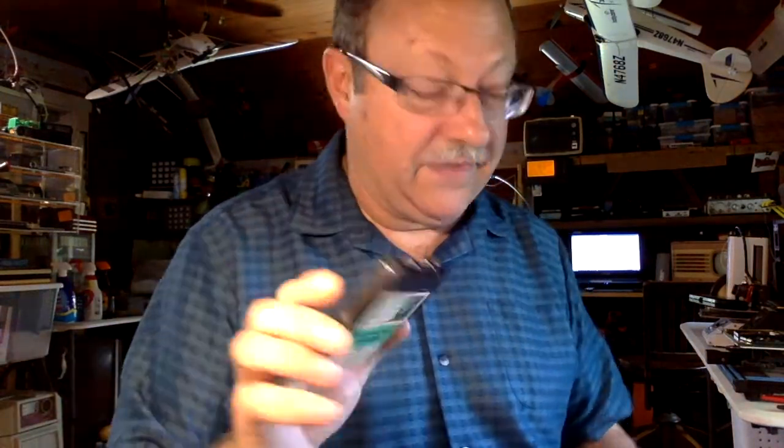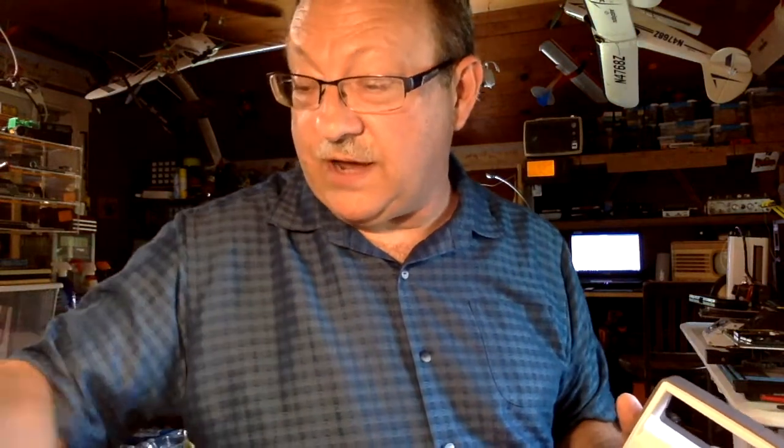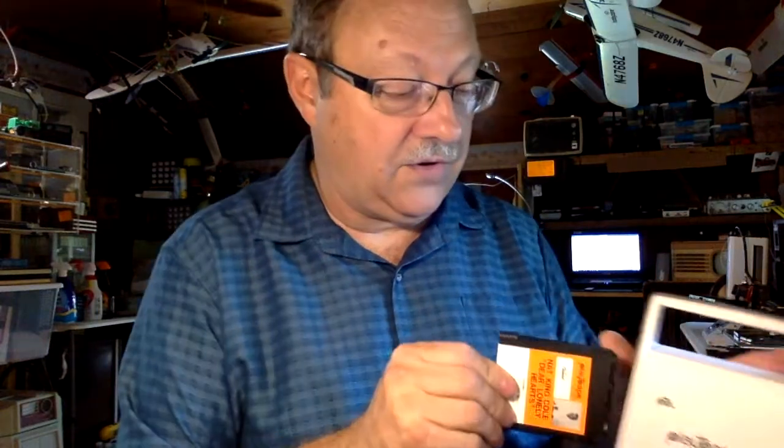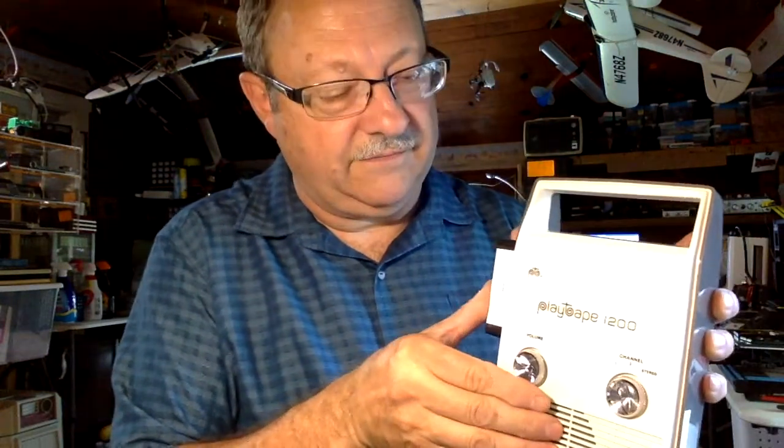Oh, there's no felt at all on that tape. I didn't realize that, so I got to replace the felt on that one. And you notice Nat King Cole is in pretty bad shape. All right, here's Glenn Campbell. We just listened to that one a minute ago. Let's try Nat King Cole with some decent felt. Okay, there's a Nat King Cole with some decent felt. See, works fine.